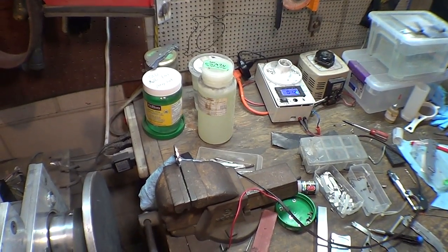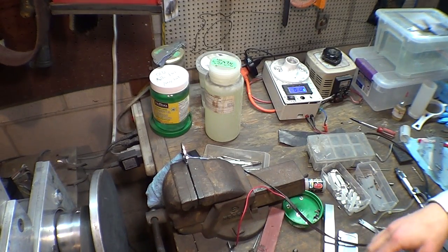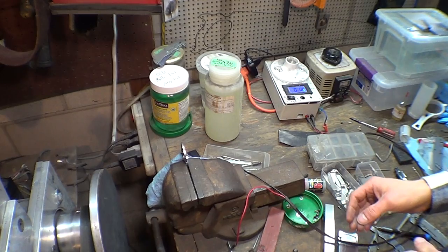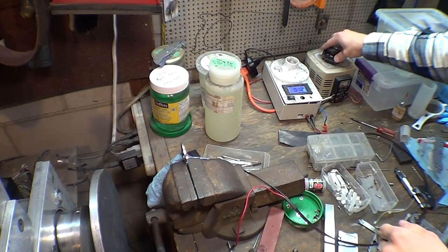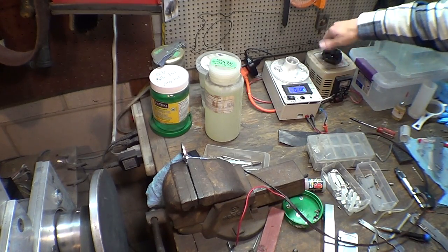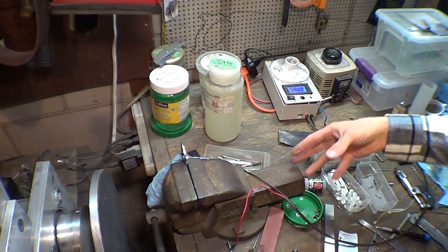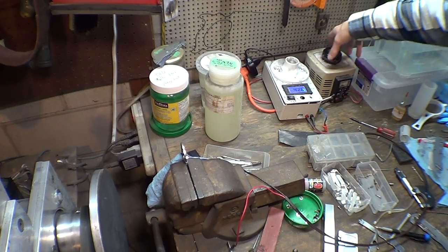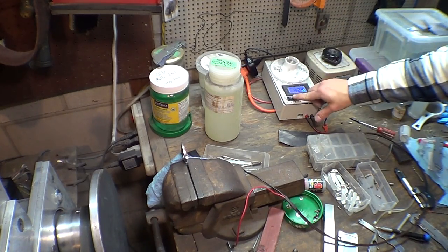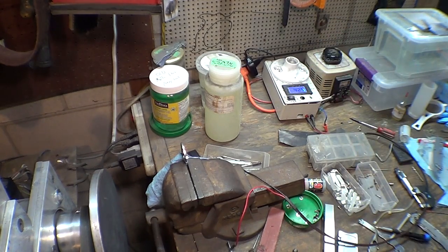For carbidizing, I have found that 40 volts is perfect. Used to try 20 and 30 and whatever. I love 40 volts. I haven't tried any higher. It might give you a bigger crystallized structure, but I like 40. And conveniently enough, when you use this and use it always at the same setting, and especially this that kind of draws a lot of current, there's a little notch. I can feel a little notch in the turning, in all the windings inside. So without even looking, I know that that's 40 volts, because that's where the notch is. And it's 42 now. That's fine.